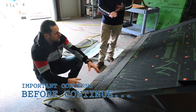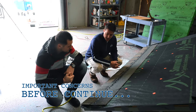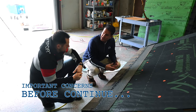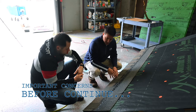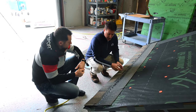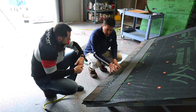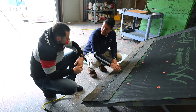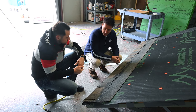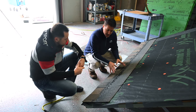What's the coldest temperature I can install your shingles in winter? There's a lot of misinformation out there. You can install shingles in any temperature, but there are a few things to be conscious of when it gets too cold. You have shingle brittleness - it'll crack, it won't be as flexible. Most importantly, your sealant line is not going to activate to hold the shingle down. We recommend the seal line activate at 40 degrees and above. You can install in colder weather as long as you go back and put some asphalt cement to aid the sealing process.